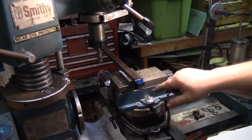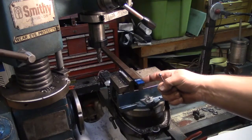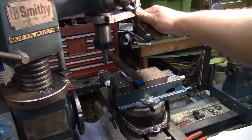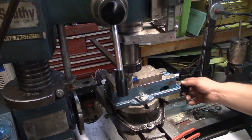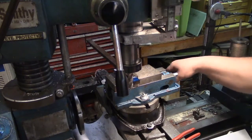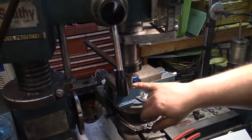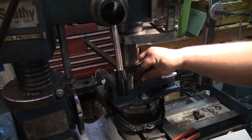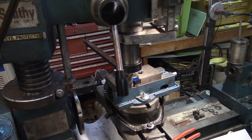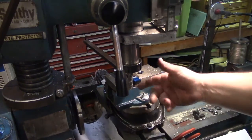To make it easier I do have to do these outside cuts, so let me get something started here at right angles — five degrees off this corner and five degrees digging in over here. I'm right at 315 now. I want five degrees this way, so 310. Doesn't have to be precise; you just want the clearance. The more precise you are the more you match the bottom pad of the bit so it gets good support all the way around. Then to get my bottom relief I can just hit that with the belt sander to get that seven degree — I can probably swing it on the vise somehow, we'll get there.